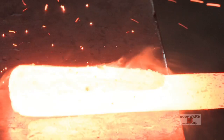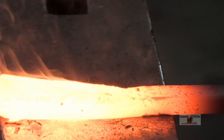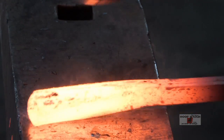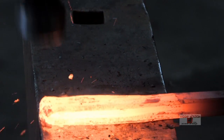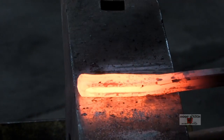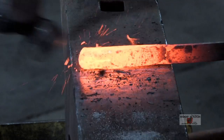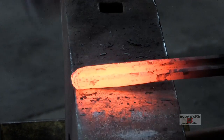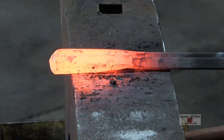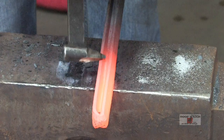I'm going to get the back of the wedge and then slowly come forward. You can see it grow, and then I'll pull the tip together — get all that tip together, put it all together, come down the sides, and then just close up my heel. As you can see after my first welding heat, I really haven't done that much damage to my section.